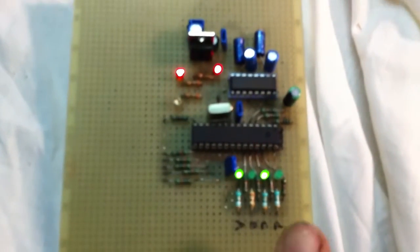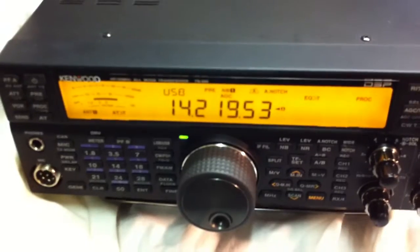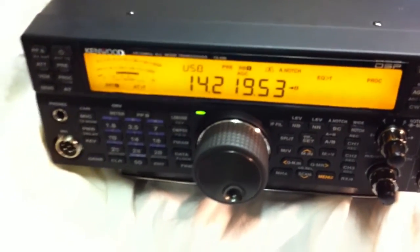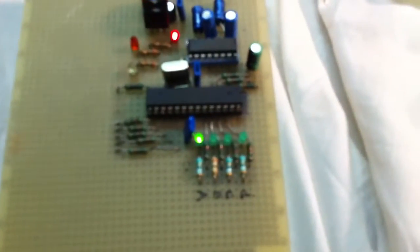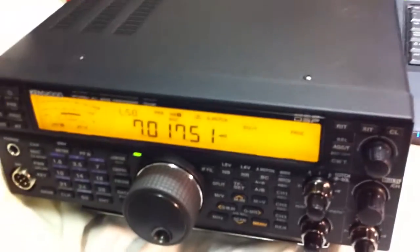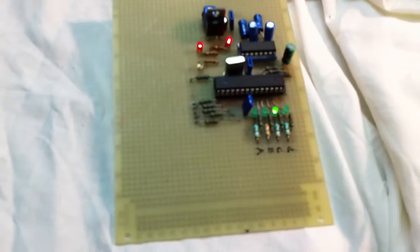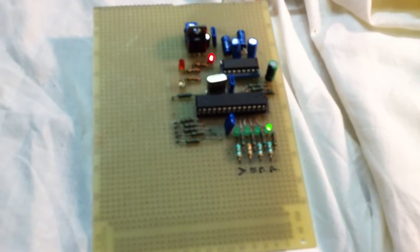What we see here is 0101010 — and this is the band data information for 20 meters. For example, if we go to 160 meters it should be 1. And you can see here it's running on 1. Like this is 80 meters, 40 meters, 30 meters, 20, 17, 15 meters, 12 and 10.